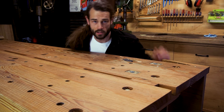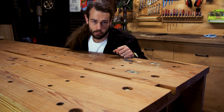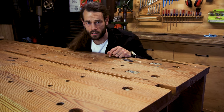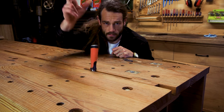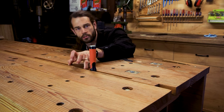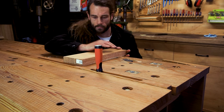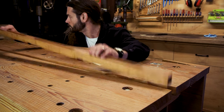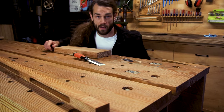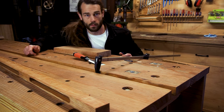This particular bench is equipped with a center rail. They're not strictly necessary for viceless woodworking, but they can be quite handy. Keep tools out of the way and on deck by putting them in the slots. You can bump it up a notch, and you have yourself another planing stop. Or you can remove it altogether. Now you have room for bar clamps or whatever.